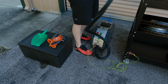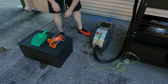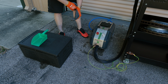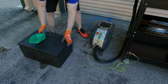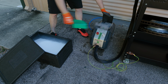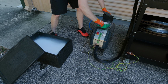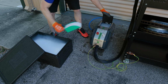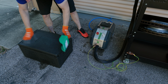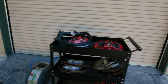Just get this thing set up here, unwound. So this is the detailed machine. This isn't like I'm gonna make $1 million a year off of my dry ice cleaning services. Right now I'm under power. I have a 5-horse compressor. You really need a bigger compressor to get the full effect out of this thing. But all you do is pull this little trap door. Here's my ice, which has been sublimating all weekend, and I'm gonna put it in the machine, just like this. I had about 100 pounds, now I'm probably down to 65 pounds or so, because I should have done this on Friday and I didn't. But this is a very specific pelletized ice that you have to get from Airgas, which seems hard to get.